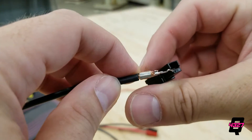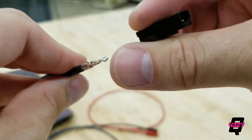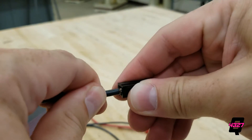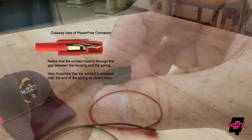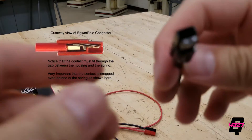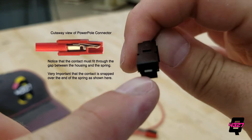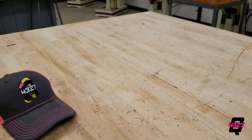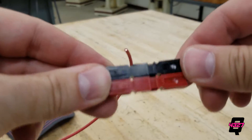As a tip, there are two metal wraps for the wire — a long one and a short one. Make sure no wires go past the middle wrap or else you will have trouble in the next part. Now insert the terminal into the Anderson connector until you hear a click. There is a characteristic snap to know you went the whole way. If the wire can wiggle inside the connector back and forth, then the terminal is not fully seated. If you cannot get the click to happen, then you likely fed too much wire into the metal terminal — start over.